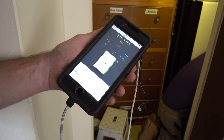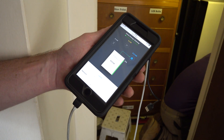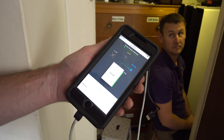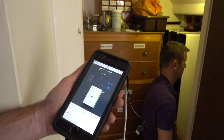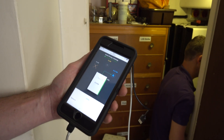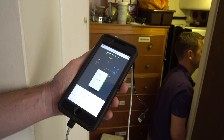Ready? You're going to disconnect the mains now, and the battery should power the house with the grid disconnected. Is that gone? That's disconnected now. The lights are still on — everything's still working in the house. Not even a flicker. The mains is off. So that is the backup gateway doing its job, and it has seamlessly switched over. There is literally no loss of power in the house — not even a flicker in the LED bulb, which would have gone off instantly.